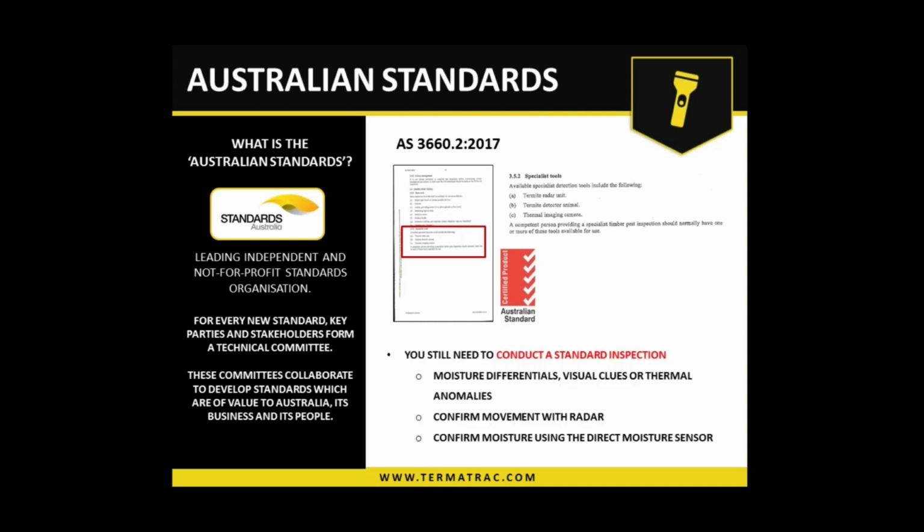But we still need to do a standard inspection. We do need to do all the standard things we would do: timber sounding, visual cues, looking for oblique lighting techniques, and then also moisture sensing. But obviously, primarily if you're dealing in a timber and/or plasterboard style buildings.